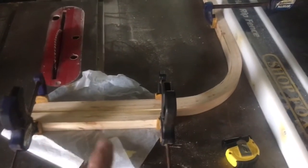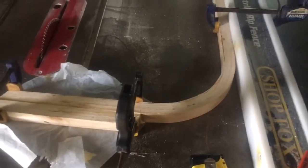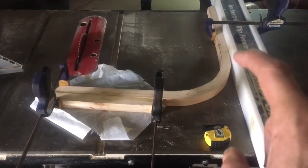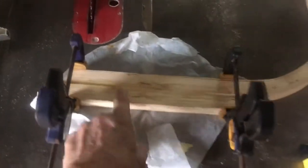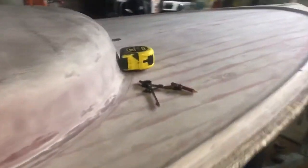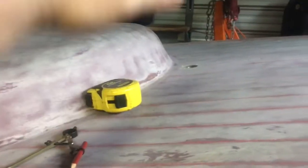This piece is going to be completely encapsulated in fiberglass resin, so it'll essentially be a plastic-coated, waterproof piece when it's done. Because it's not a perfect 90, you can see right there — if it were a perfect 90 and clamped to the fence, it'd be parallel to the line on the table saw, and it's not. So I've added another laminate, and once it's all dried we'll trim it. This part will end up bolted to the bulkhead, and this part will go up underneath the deck.